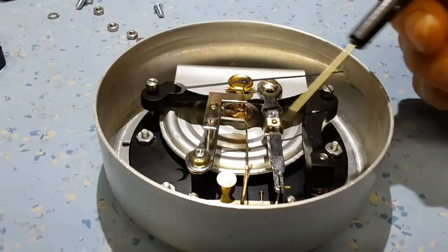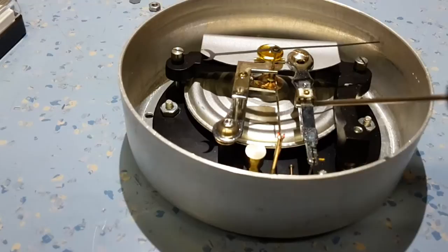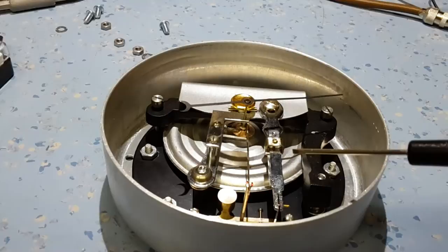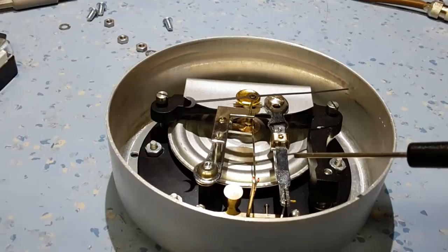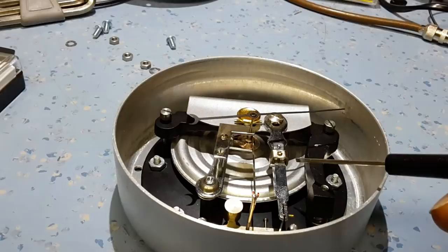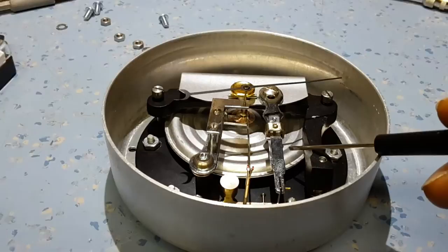At the heart of the barometer is the diaphragm here, which is the cylindrical round bellows. This is the part that actually measures the air pressure, and this is the part that can fail and lose its vacuum. If it goes to air, then the barometer is obviously useless. Some aneroid barometers have evacuated all their air, though sometimes they have a special gas in to attempt to compensate for temperature changes. But this one is probably more or less a total vacuum inside — as good a vacuum as you can get.